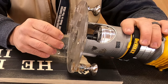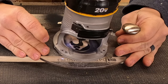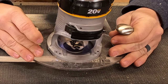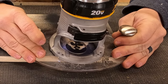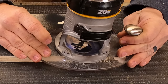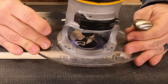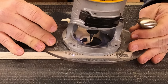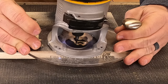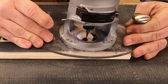The first bit I used is a carving liner at an eighth of an inch deep. I only used it for a small portion — where the Sasquatch makes the heart with his hands, which is hilarious, and also the fingers. Those are really small lines, so I used the carving liner bit for those. This is a super fine detail bit, so you don't want to carve any more than you absolutely have to — it dulls quite a bit faster than the other bits, but for something like this I don't think I could have done it with a profile bit.